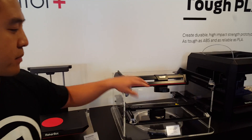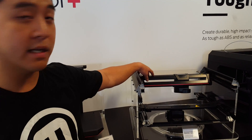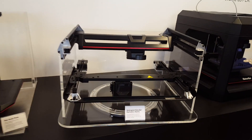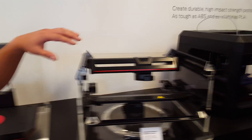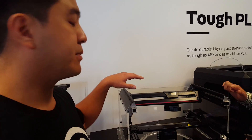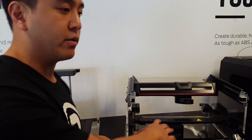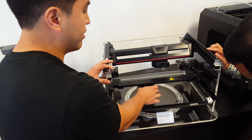In addition, we improved the gantry system. The old Replicator 5th Gen gantry is on the bottom; our new Replicator 5th Gen Plus is on the top. Using new materials, more advanced techniques, and leveraging our expertise in linear motion, we've been able to redesign the gantry to be significantly stiffer, easier to manufacture, and with fewer parts. One of the key issues in the H-gantry was racking — the unbalanced forces in the H-gantry — where you move back and forth and you can see motion, racking.